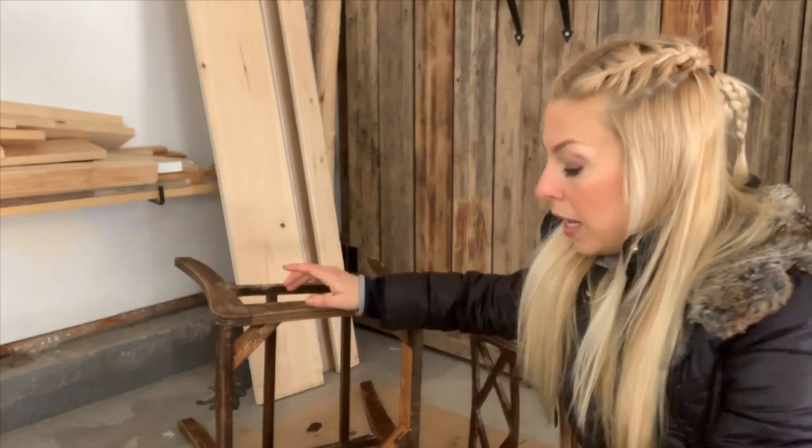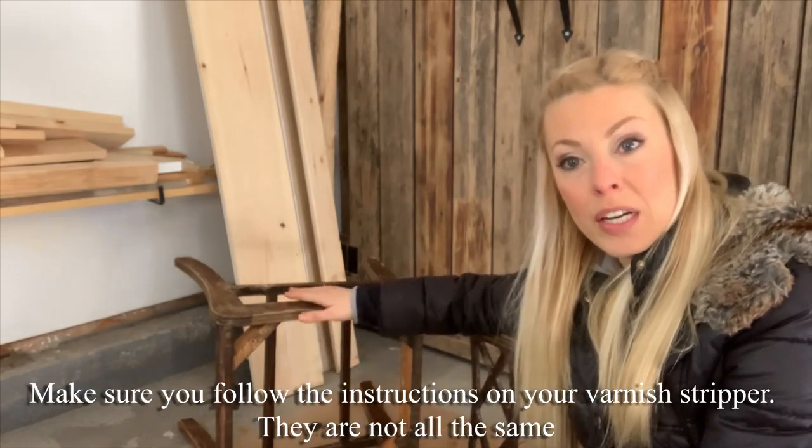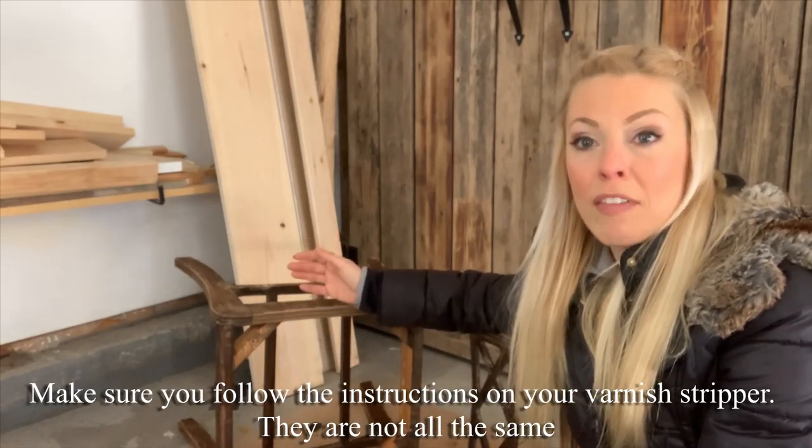Because there's a little bit of varnish overtop this old stain, I'm going to be removing that varnish with a varnish stripper. So in this case, I have to pour this stuff on, spread it out, and then I let it sit for about a half hour.